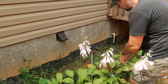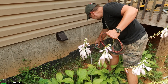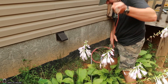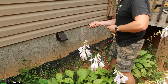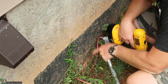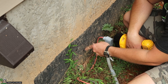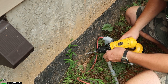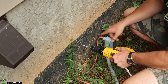I've made it to the house with the wiring and I'm going to be using this LB box to make the 90 degree turn into the house. So far things are going pretty smoothly. I went under the house and measured where this box should be attached to so that it's not on either a seam or a cross piece of a block underneath. And I should be able to get right here and be exactly where this box needs to go.